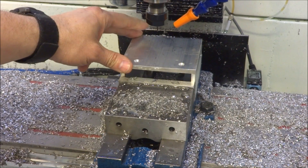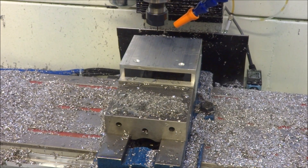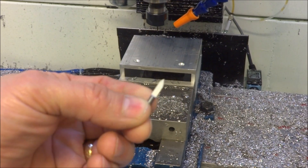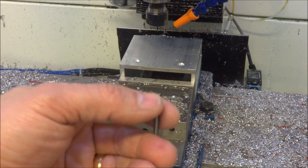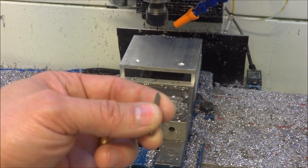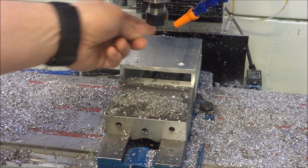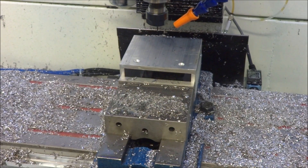So what I have here is the y spacer and I'm just going to engrave a directional arrow here for the y-axis. I've used these carbide engraving bits but they kind of give a rough groove inside — they work but they're not as nice as the finish you get from just a standard center drill. I've got a center drill in here and I've already done one with this bit, so I'll show you the difference when I'm done. A cheap center drill works really well — this is an eighth inch center drill and we'll see how it does.